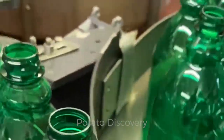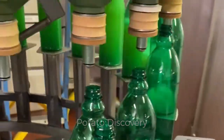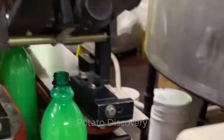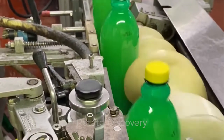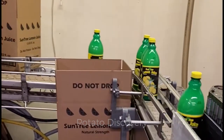For shipment overseas, single-strength juice will be costly to transport in drums, and the juice may be concentrated to about 5 times for economy in transport costs. This requires expensive equipment, and consequently, a high production level of juice is needed to offset the capital costs of concentrators.